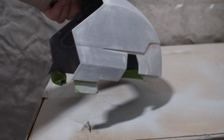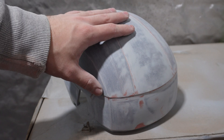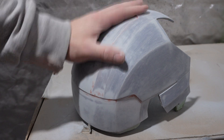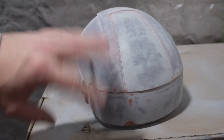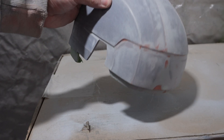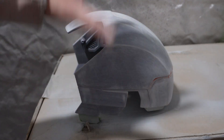The dome has been completely sanded smooth using 220 grit sandpaper. I didn't bother wet sanding it since we have body filler and spot putty on it — those two things are extremely hydroscopic, so I didn't want to put any water on it. Now that this is perfectly smooth, I'm going to hit it with another heavy coat of filler primer, then repeat the exact same process of fixing any imperfections found. We'll repeat that process over and over until we're ready for the next stage, which is 400 grit wet sanding. After that, it will be ready for paint.